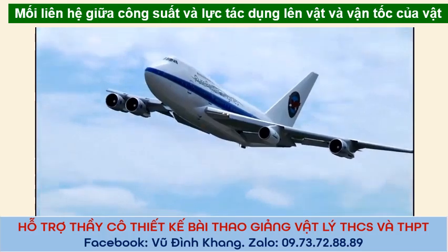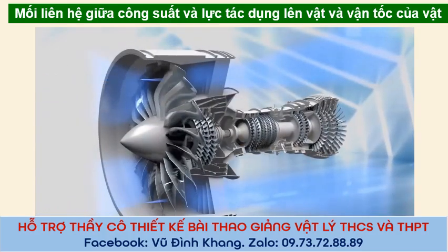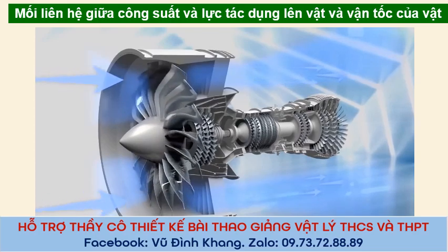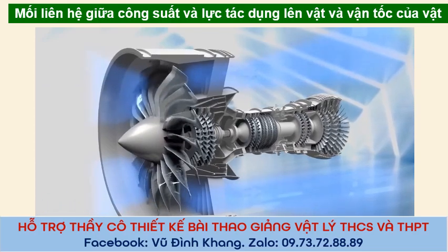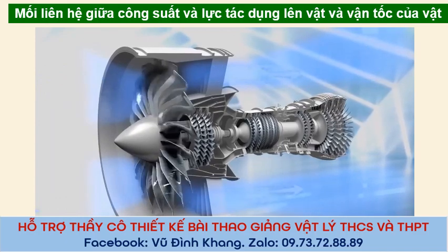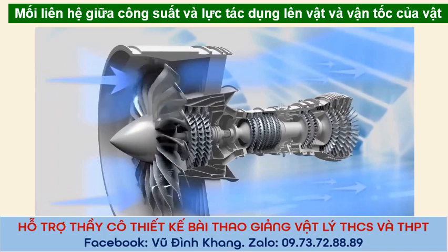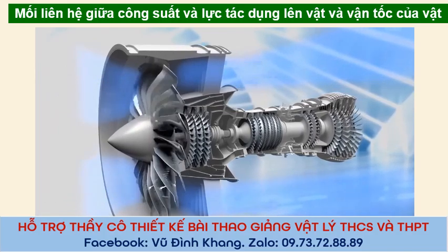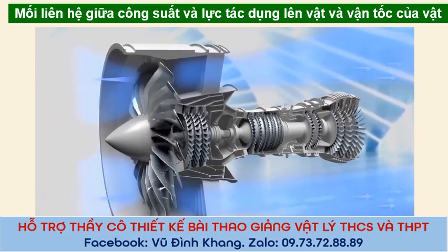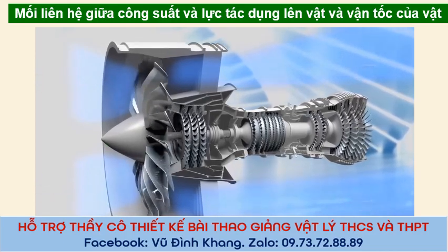Remember that air rushing outside the engine core? Together, the turbine and fan push a larger mass of air than the core ever can for much more thrust. But that extra air passing around the engine core works more efficiently if it moves more slowly than the hot air rushing out the combustor and the back of the engine.